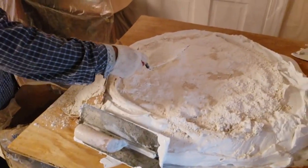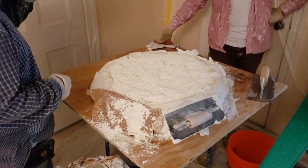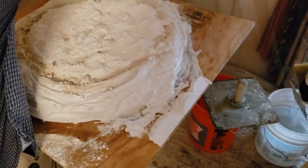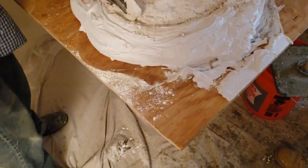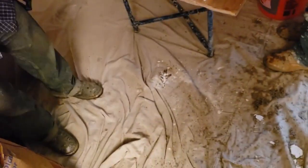Fast forwarding to filling the center in: after our center ring is filled in, then we fill the center in. The molding plaster tends to float on the surface, so we fill the top. Now this is a wiggle test — see how soupy the mortar is; you can wiggle it. It's going to be a little soupy when we beat it up. We're cutting a ring in the ring, which avoids water from running onto the floor. If we're finishing a ceiling we're going to let this molding plaster soak up for 15 or 20 minutes to make it easier to mix and lump free.